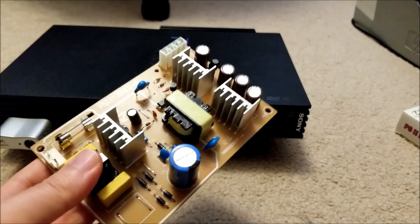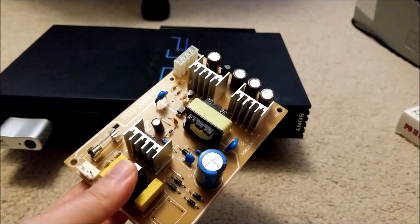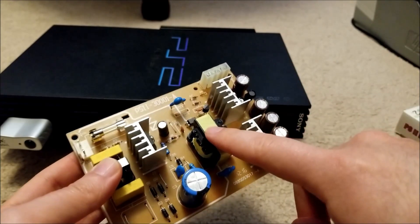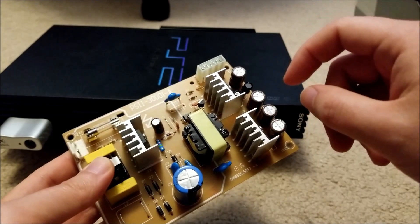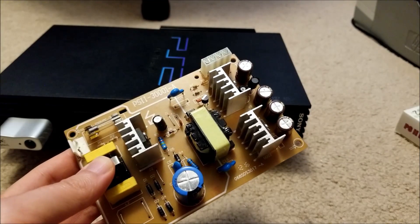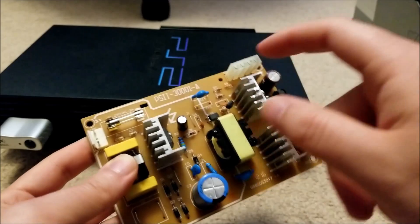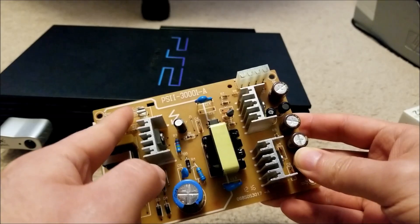I actually did a little debugging — I was going to make a video on the original supply. It ended up that I don't know what went wrong, but multiple things failed on the output side. The input fuse to the primary side of the transformer failed. And I believe the output diode rectification — near the output side there are two diodes in parallel — one of them failed shorted, a dead short. And I think there's something wrong with the opto too, so some catastrophic failure happened and it ended up taking out the input fuse.